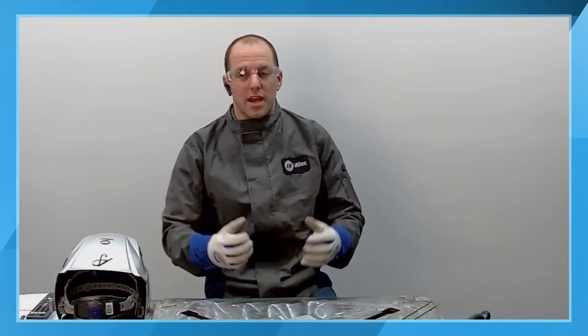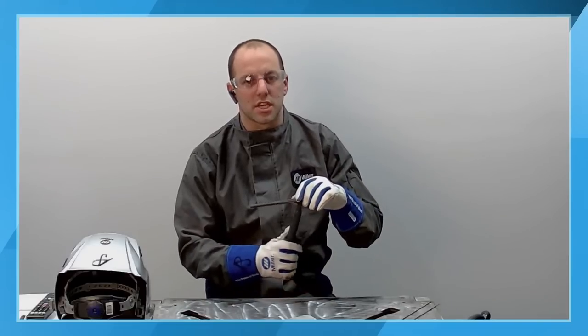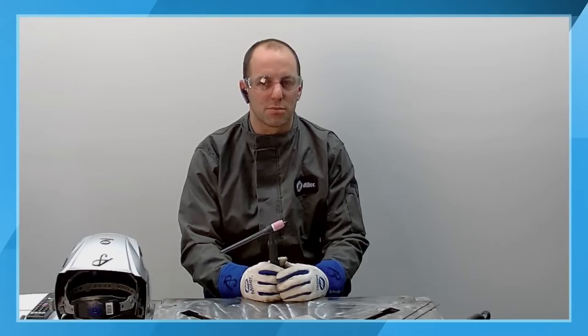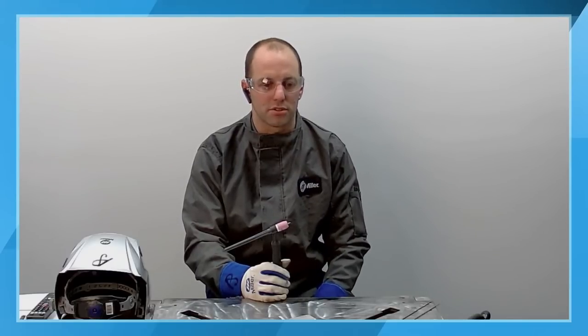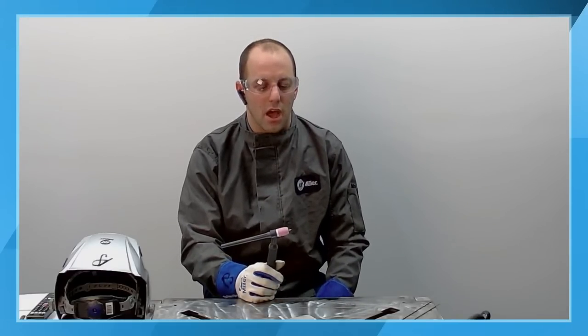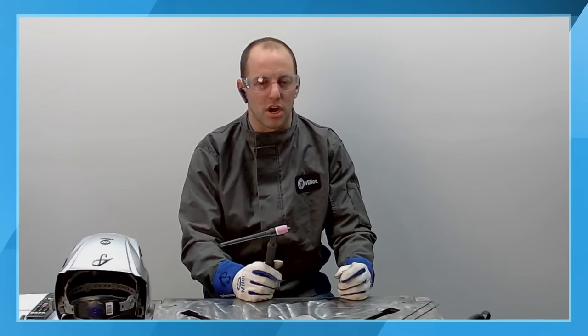So, going to open it up for a couple more questions. There's a question that came in. I'm using ceriated tungsten on my old Syncrowave 180, and I'm having a hard time. It's not really turning out too well. If you're using an old transformer-based machine and welding on aluminum, it may still be advisable to use a pure tungsten or the green banded tungsten. Then pre-ball that: switch your selection tap to electrode positive, and pre-ball that tungsten on a good piece of clean stainless steel or a good chunk of aluminum if you're welding on aluminum. That is used with the AC, or alternating current, welding process. If you're welding on steel or stainless steel, a 2% ceriated, ground to nearly a point with a little bit of a truncation or a little flat spot on the end, should be a good place to start. You should get good results with that.